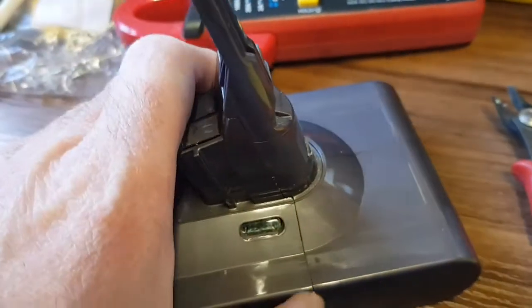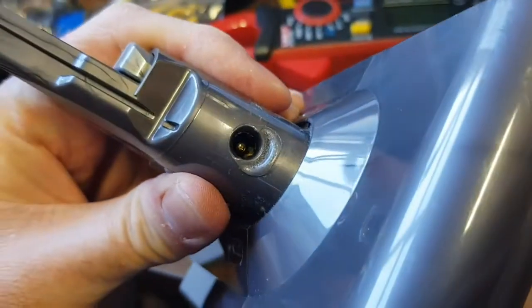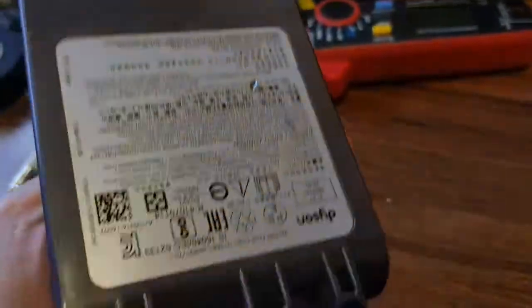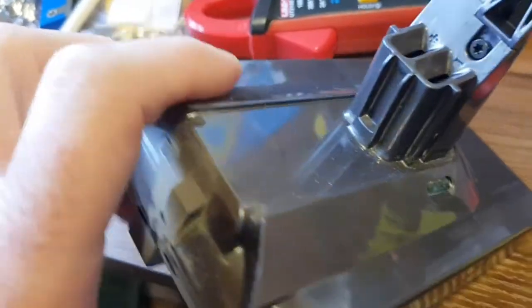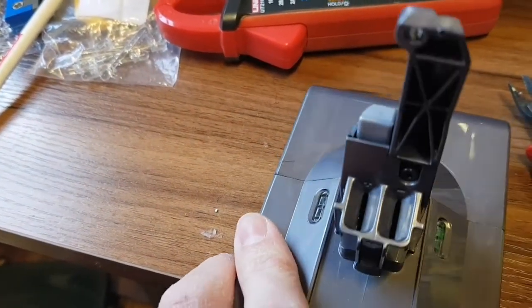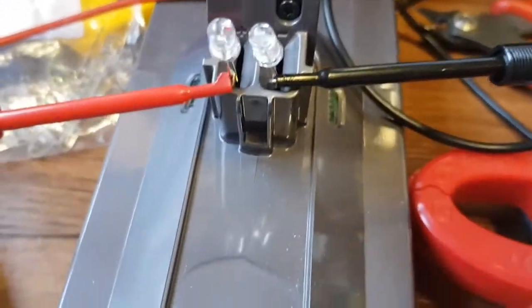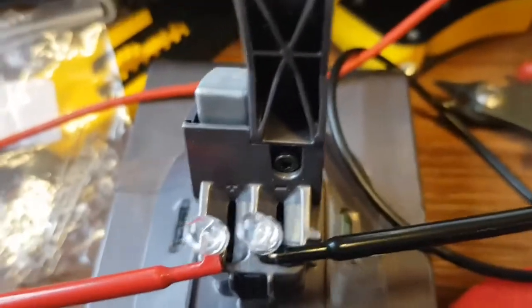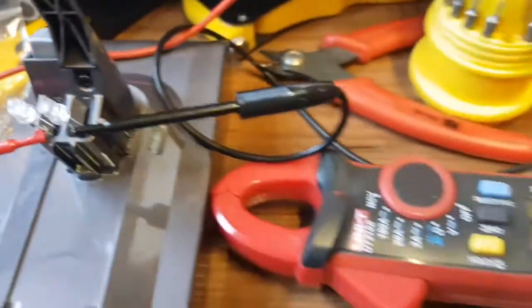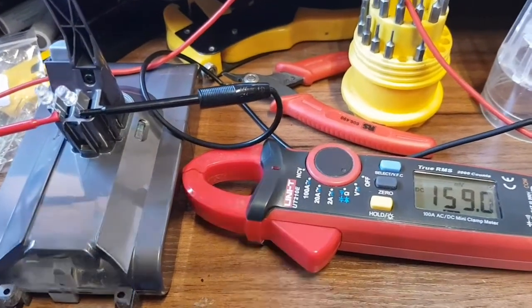It's a completely sealed unit. You can see there's a shut line in there - it's probably all glued, I don't think there's any screws around it. Is there something under the label? Probably all heat staked. Let's see if we can put some pins in there and see what we get. So LEDs shoved in the holes, fitting nicely on the contacts, which gives you a nice point to probe. It's even got plus and minus marked up on it. So there's the meter reading a few millivolts at the moment, and we push the button on the battery.